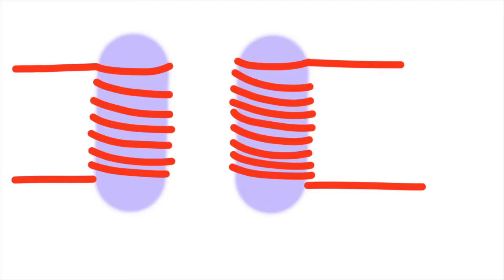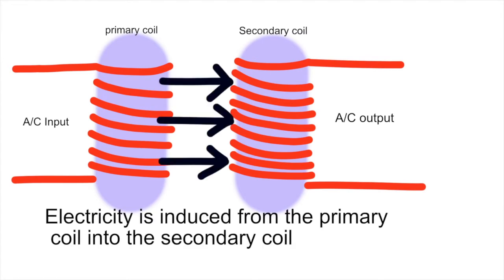Another common source of interference is the 120-volt electrical lines in your house. The nature of alternating current is that it alternates between positive and negative — in our house it does this 60 times per second. This rapid shift from positive to negative emits an electromagnetic field that can be induced into a nearby conductor. That's actually how transformers work: two coils of wire next to each other, and current passed through one coil basically jumps into the other with different properties of voltage, impedance, and current.